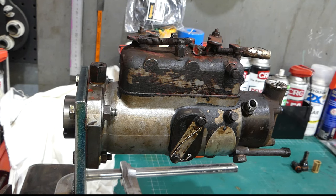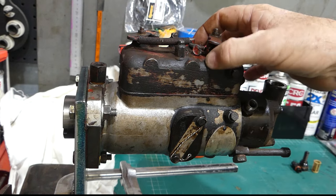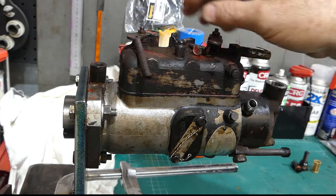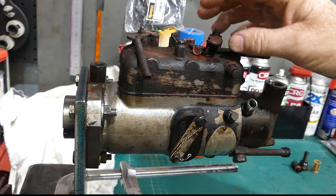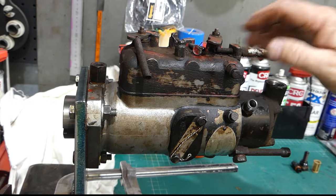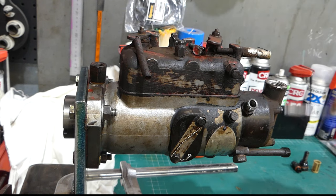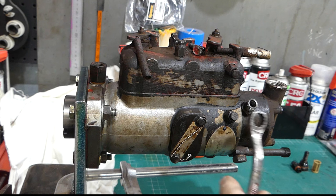From sitting, pumps can get stuck in the metering valve — I'll show you that on the way through. They often start leaking up this shaft here, the throttle and the stopper shaft, from sitting or even if they get used a lot. We'll run through that as well.